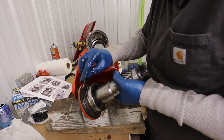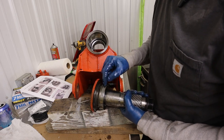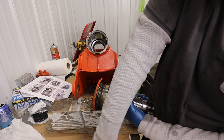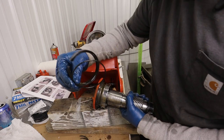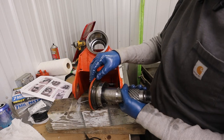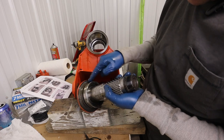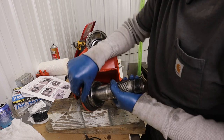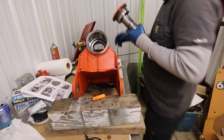And there's a groove there. Okay. Yep, so there was a locating ring, and then there was this two-part seal, kind of an oil-piloted seal, that had failed. That was probably our failure. And then there's that Viton with a kind of a locating feature ring, I guess. That guy's ready to get cleaned up too.